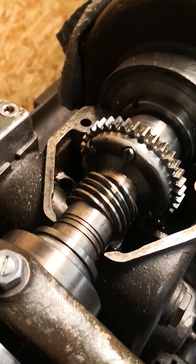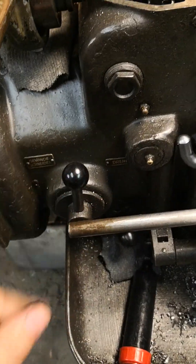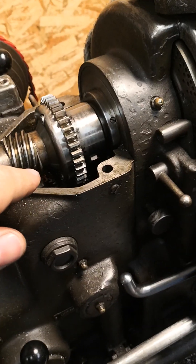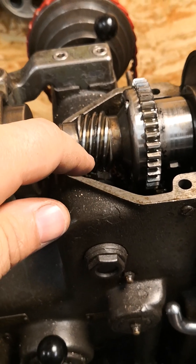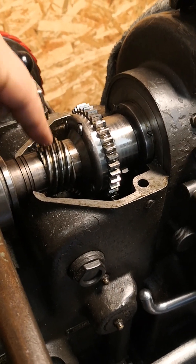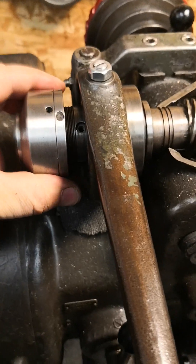They write in the manual: when you don't use any of these mechanisms, pull your lever to the middle and nothing is engaged, so no gear movement is made and no material is used up. Because those are brass — there's a brass gear down there — it will get chewed away by the steel over time, but this takes a long time, at least 20 years is my assumption.